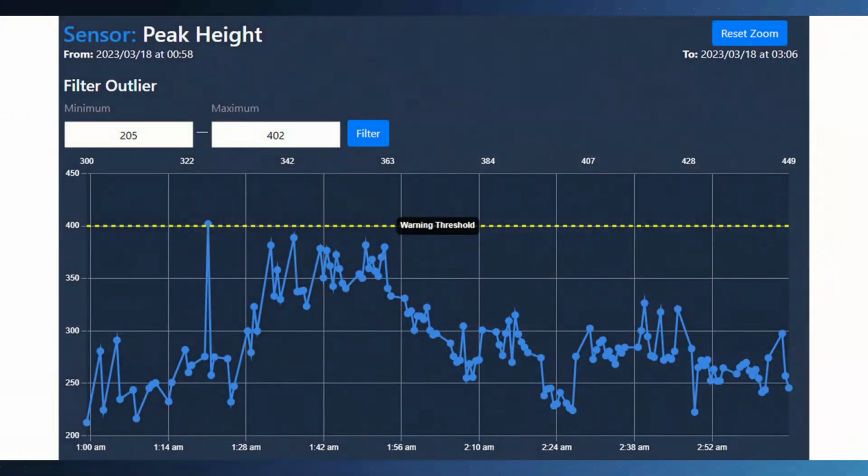Well, I guess I meant, how often does the system take an image? Not you specifically, but how often does the system look at it? Every layer. So we document the entire build process. That's actually also really useful to the end customer to prove, here is the data layer by layer, after recoat, after lasing. We can tell you for any layer of the build how the powder bed quality was and how the protrusion tendency of the part after the laser emission was. And if you give that to a customer, that creates a high level of confidence in the quality of the process.